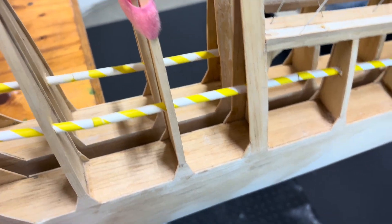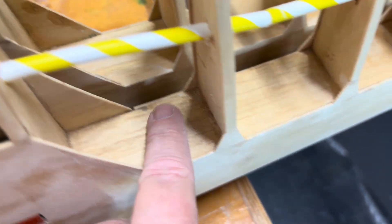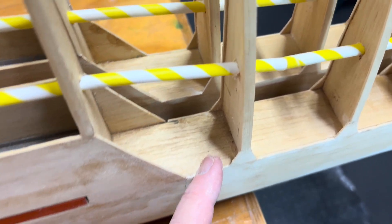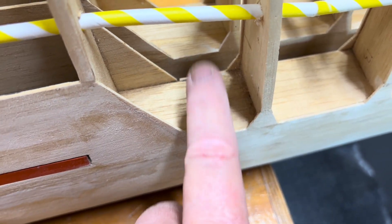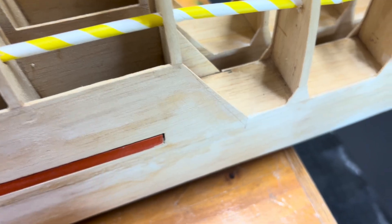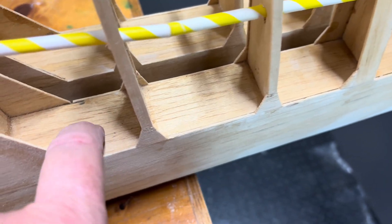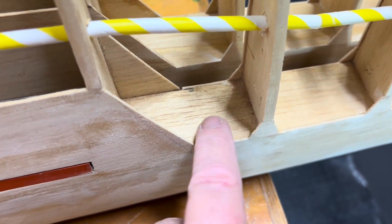With the panels together on the lower surfaces, the next issue I face — according to Cliff Charlesworth's plan — and in my father's defence, all of these webs between the spars, or behind the spars rather, are all horizontal grain. This model's had two significant accidents and these webs were split right along the grain. They should have been vertical grain from the start.